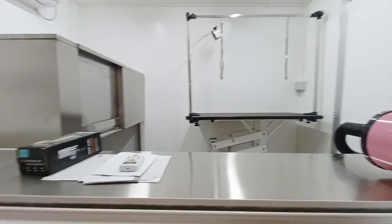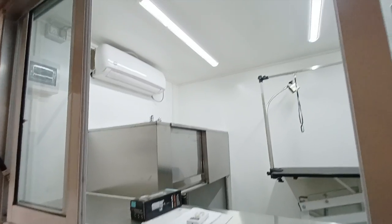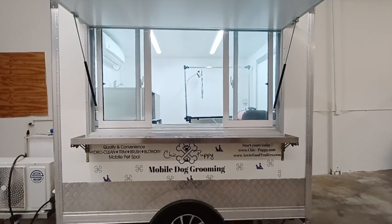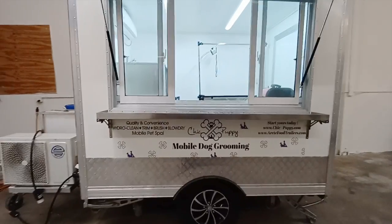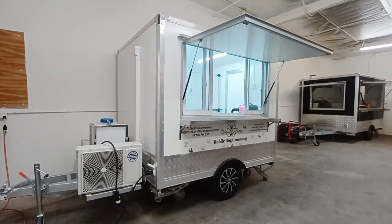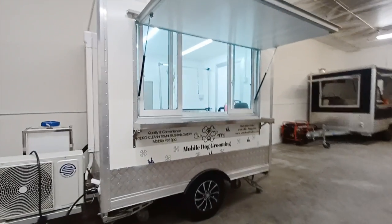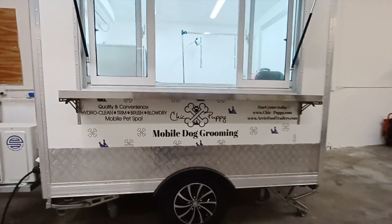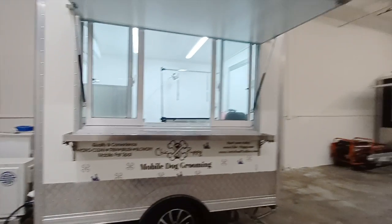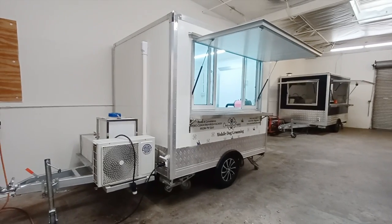On this particular unit running 30 amps, you only need to run the dryer, hot water heater, water pump, AC, and LED lights — around 4,000 watts total if you're running everything simultaneously. This is a good look at the 8-foot model, typically good for one to two people on the inside. This one in particular is for dog grooming — you can see the decal logo specifically for our partner Chic Puppy brand, who's doing dog grooming franchises affiliated with our company here, Arete Food Trailers. This is the 8-foot box model.